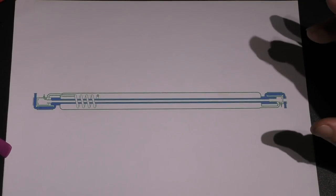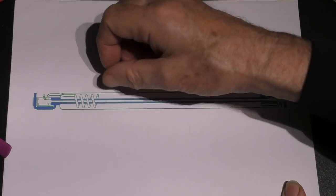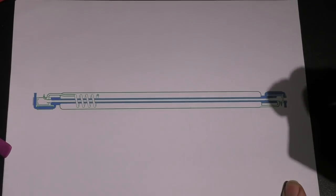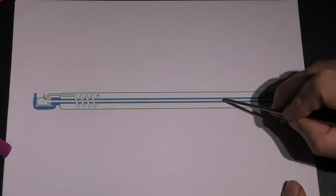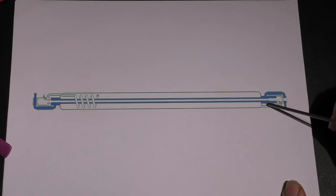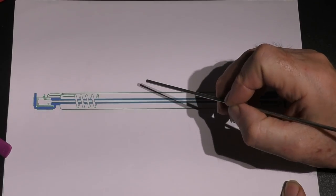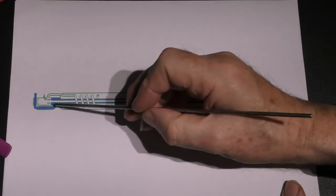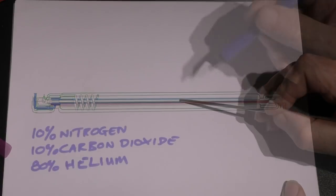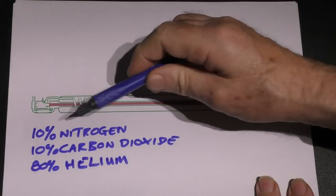We're going to start looking at lasing in the form of the CO2 gas tube laser. The outer tube contains a gas mixture that can also run through to the middle of the tube. There are three tubes: the outer one and the inner one are joined together, and around the outside of the inner tube there's another tube full of water, which carries heat away from the central tube. Within these tubes we've got a mix of gases — and all gases are basically non-conductors of electricity.